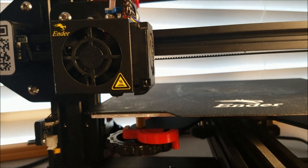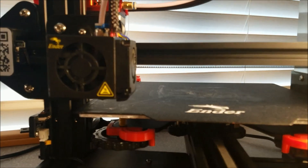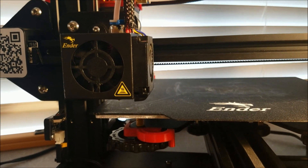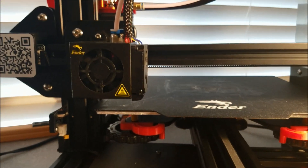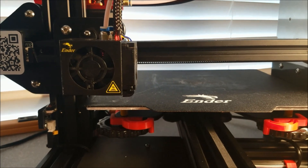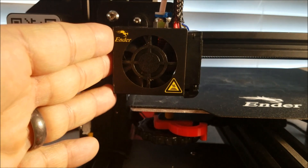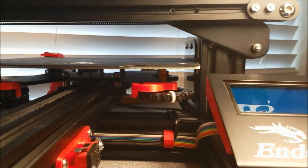So in the description, I have links to every part used. I had most of them in my junk drawers already, but in case you don't, there's a way to find every one of them. And the G-code I changed is in the description as well. Basically, all it does is raise the head at the end of the print — the Z direction moves up about 20 millimeters. And then it sits and cools. And then when it's over, it moves all the way over to the stop, and the bed extends all the way out. And it shuts off the power.